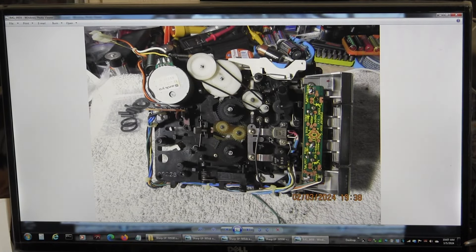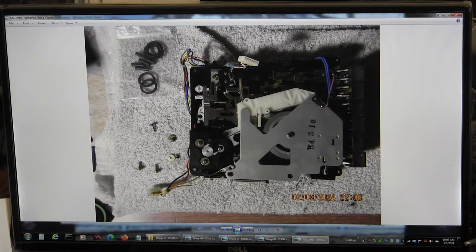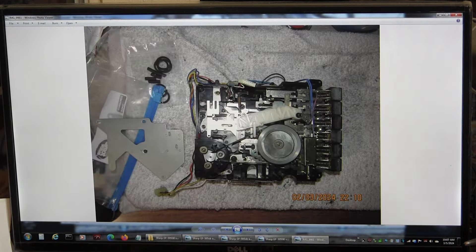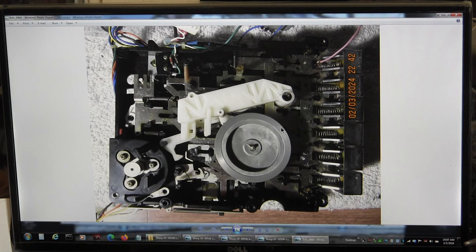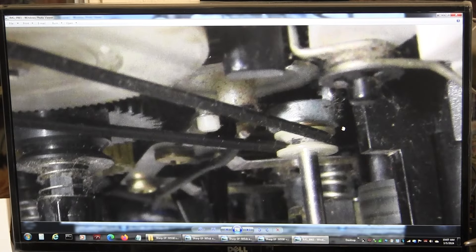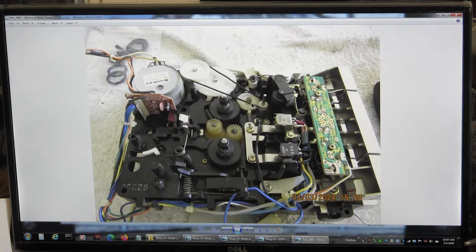Here is the other side of the tape deck, still with the old belts and the old everything. Now, I didn't need to go this far but I did — you have to remove this to get the flat belt off. Here we remove that, and remove that. Here's an upside-down view of that belt and how it's on there. Another view of that. Still dirty.